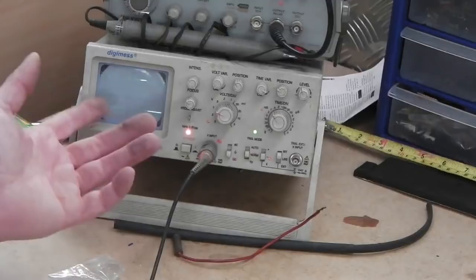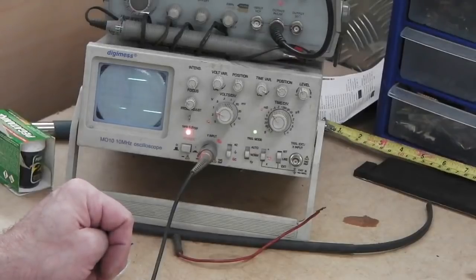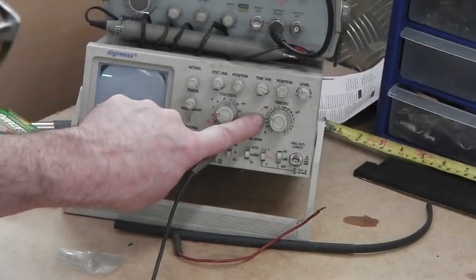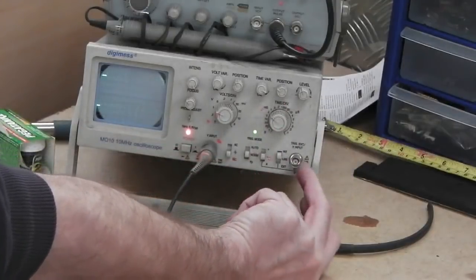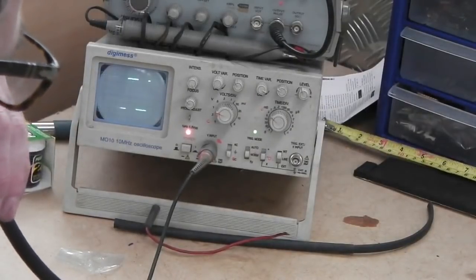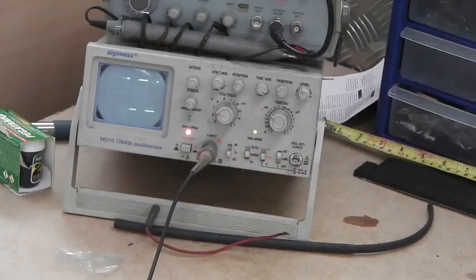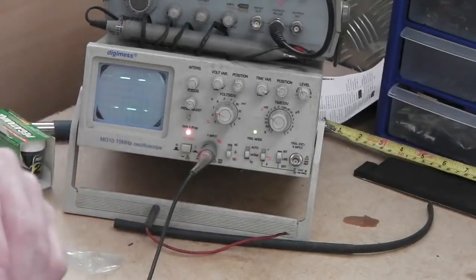So based upon this, it's looking like it's around the 120 Hertz range, around that area. Just going to make a quick guess on that, on volts division, oh, milliseconds division, sorry, 0.1 milliseconds. So Hertz wise, looks like around the 120, then changing to, not a very lot, it drops frequency as I draw on it, so that goes down to say 90, 100. 90 and 100, and I'm drawing on this pretty hard.